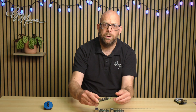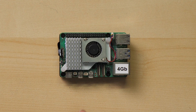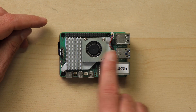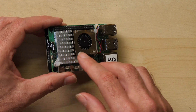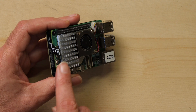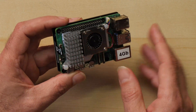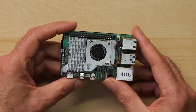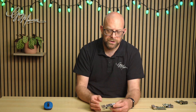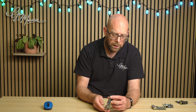That's all good and well if the Pi is out in the open with nothing blocking it. But looking at this Pi 5 with the official heatsink and fan, the Wi-Fi antenna sits just outside it but the heatsink is going to shield quite a bit of signal. If your main show is in that direction, the heatsink gets in the way. Coming the other way, there's a PCIe ribbon cable dropping down to the NVMe base underneath — more potential blockage. With all this metalwork and activity around it, it's going to have a hard time maintaining a good signal and seeing your external access point.